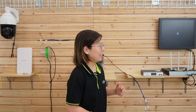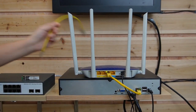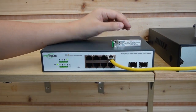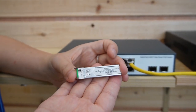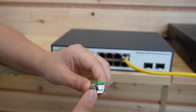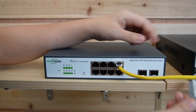Let's do the connection together. First, let's use a short patch cord to connect our router to the NVR, and then use another one to connect the router to our switch to provide data. Now this is an SFP transceiver — we'll need this because this is where we connect the fiber optic cable. It is usually sold separately because it depends on what kind of fiber optic cable and connector you use. So let's plug it into the SFP slot.